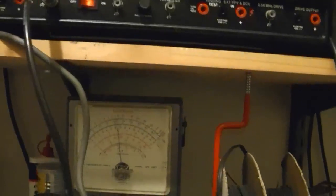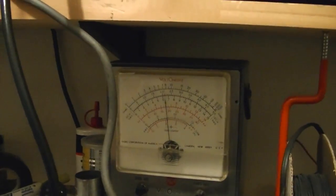Yeah, okay. So you can see that there's stripes in the center of the screen there. The camera's picking that up. And it's right around there they kind of disappear. The instructions said to back off a couple volts from that point, so that'd be around there, which, not surprisingly, is about where it was before I started. I kind of thought the picture looked pretty good when I started, but it doesn't hurt to double check these things.